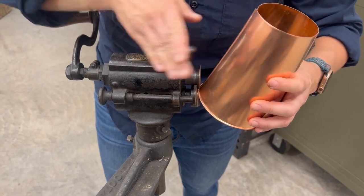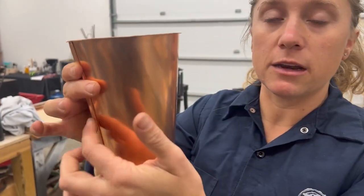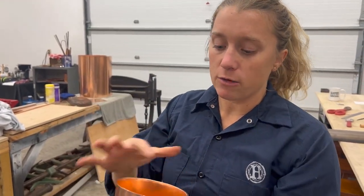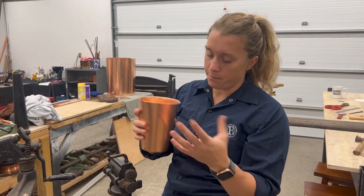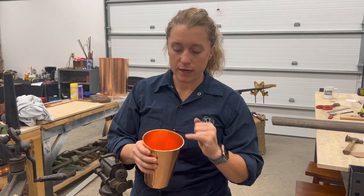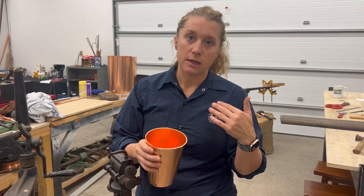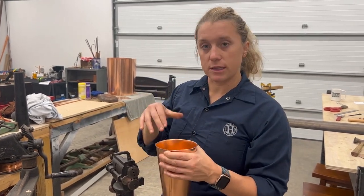I was a little aggressive in my burr here, but now I have a 90-degree angle along the base - similar to how we had a 90-degree angle on the side. The idea is that you have something you can crimp with another piece that's going to be right over the side. I can take the measurement from end to end and that will give me the math for my base. You're going to take the entire diameter and add an eighth of an inch to both sides to accommodate the burr you're going to create.